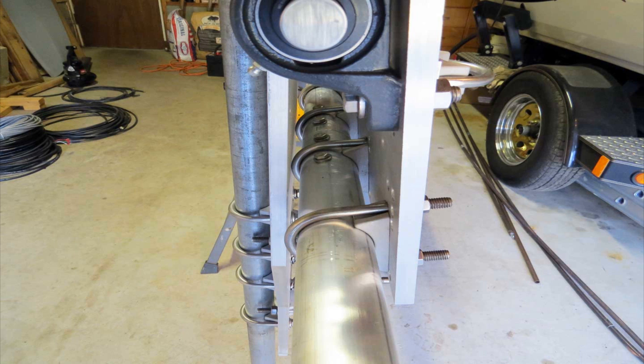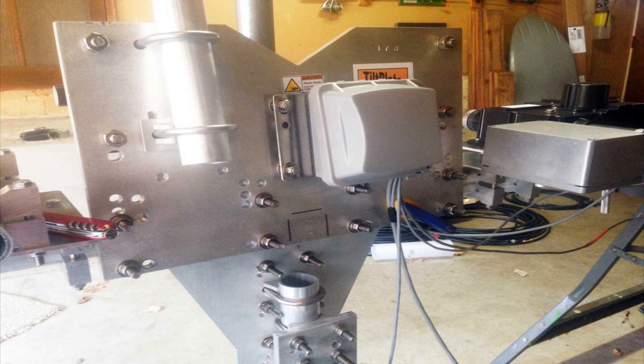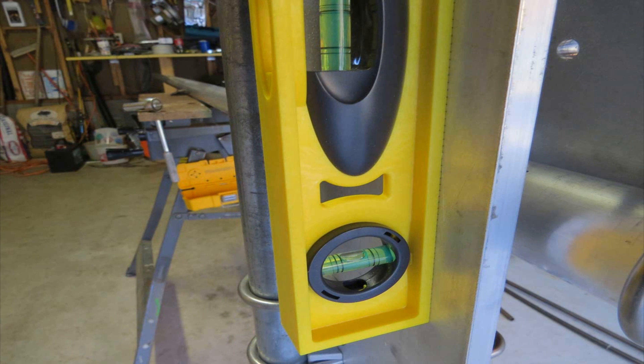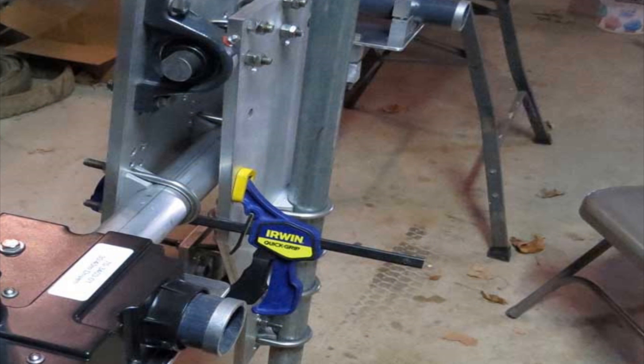Because I'm using the tilt plate, the eye bolt normally used with the antenna was not used. As you can see in this photo, when I attached the tilt plate to the boom, I used the pre-drilled holes 1, 4, 5, and 8. First we had to establish that the tilt plate was vertical when mounted to the mast. We locked the two halves of the tilt plate together using a hand clamp, which ensured that when we mounted hardware on the boom that was level, it would be horizontal to the ground.